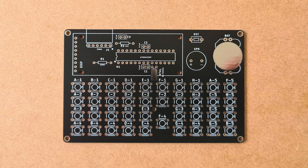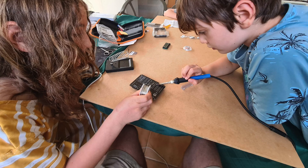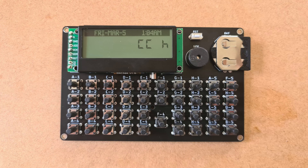The instruction sheet gives the best order to solder the components, and even my five-year-old could put the components in. My older kids who are eight and nine actually did the soldering. Here's the back of the PCB after we finished — it wasn't the neatest job, and the first time we tried to turn it on it actually didn't work. But with a magnifying glass we found two soldering points for the display were touching, so we desoldered those, did them again, and everyone cheered when the calculator started up.